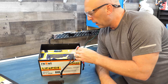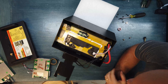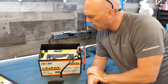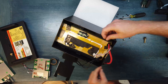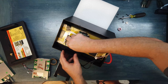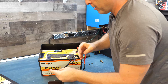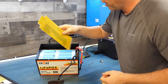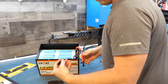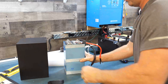The only thing left is to get the cells out. The cell box is secured to the bottom of the case with two big strips of very strong adhesive — it's almost impossible to pull out without slicing through the foam padding on the sides. What I've already done is slice down the edges to flip this back, and then we can pull the cells out. Removing the last piece of duct tape — and there you go, those are the inside cells. The leads are protected here, but this is where you want to be careful about bumping things.